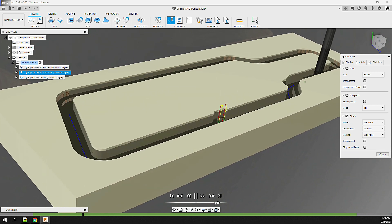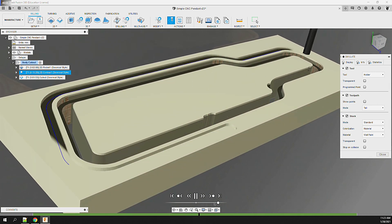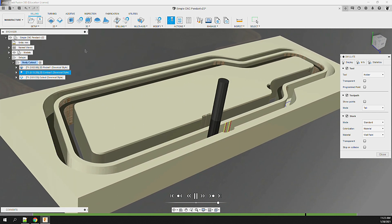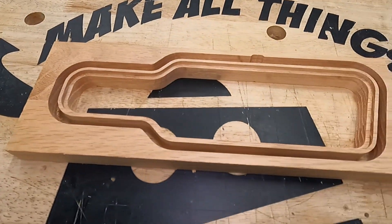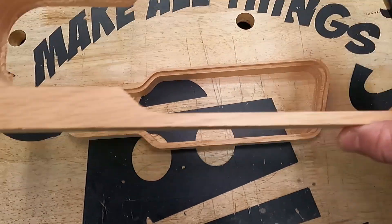The cut was super clean. The only real issue I had during the run was that the end mill extended further out than necessary, causing some deflection pushing through the hardwood. In practice, I backed off on the feeds a little to mitigate the noise and chatter. When finished, the part was clean — I hit it with a sanding block to break the edges, and it was good to go.